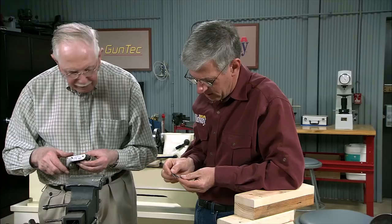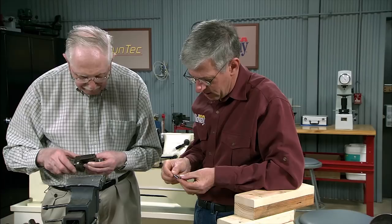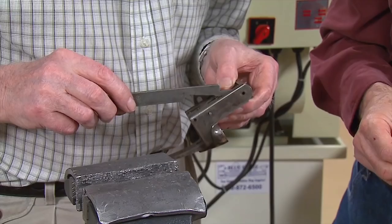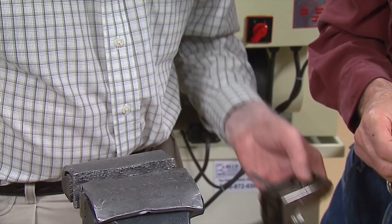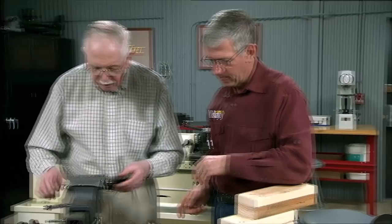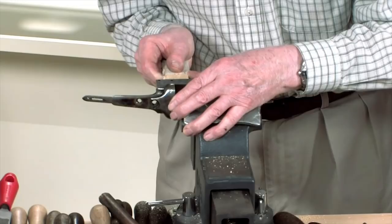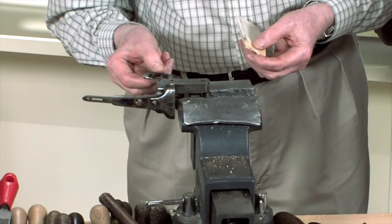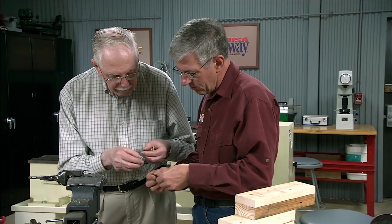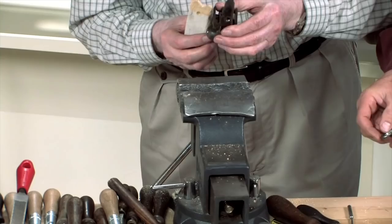And now we've hit a snag because I haven't got my piece of wood with me to take these out. This won't fit. So what you do with these things is you use a flat piece of wood and cut a V in it. A part of the hammer will hold it. So next thing is to twist that like that, push the front end down, and out comes the hammer under control. And there's the hammer complete with the slide that works the ejection, turning on the other side.